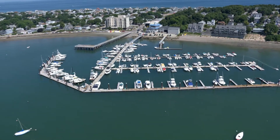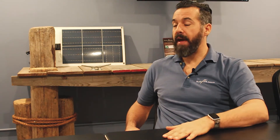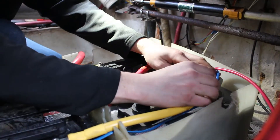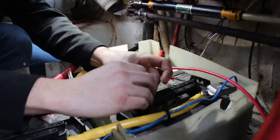If you're in Florida, the water is around 80–85 degrees and your batteries might be in air that's 100 degrees Fahrenheit, so you want the voltage to be lower. Having a temperature sensor connected to the primary battery is really going to help make sure your batteries get the right voltage under bulk, absorption, and float charging stages.